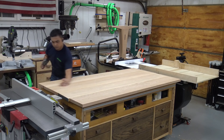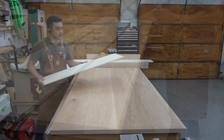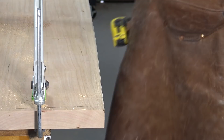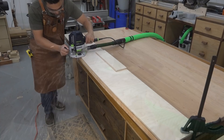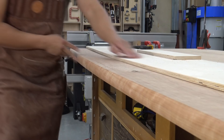Both ends of the tabletop are squared up with the track saw — I needed these ends square because I used them as reference edges for templates that will shape the tabletop. All sides of the tabletop received what Garrett Hack has coined a subliminal curve, and the edges will be treated to a nice parabolic edge. Once traced out, I rough cut the curves with a fine-tooth jigsaw. I then used a large whiteside oval edge router bit with a one and a quarter inch roller bearing to follow the templates, offsetting the bit in height to give the edge a parabolic shape as opposed to an even round-over. I then used a spokeshave and sandpaper to ease the sharp edges.